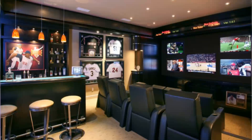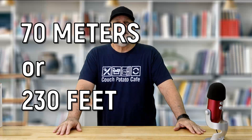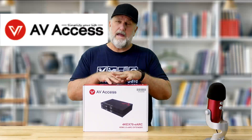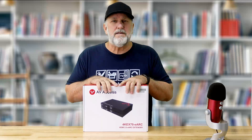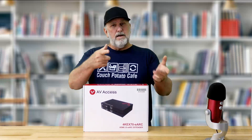Have you ever had the need to use the TV and other components from one room and watch it in, say, a man cave, woman cave, or even the bat cave, and control it all from that remote TV? Let's take a look at one of the easiest and best ways of doing this — getting 4K signal and Dolby Atmos and DTS sound up to 70 meters or 230 feet away with just a CAT cable. Let's look at the newest HDMI extender kit with eARC and ARC controls, 4K 60Hz, Dolby Vision, IR, and POC. AVAccess has a kit for you that is just fantastic.